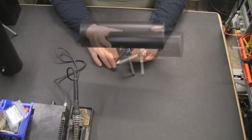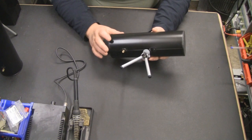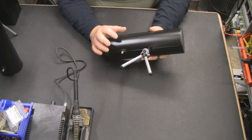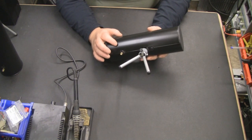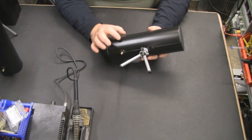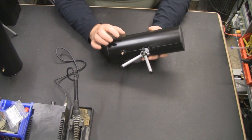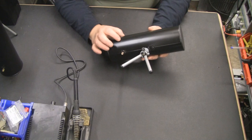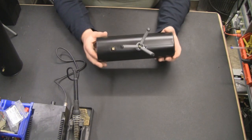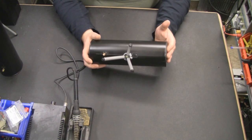Another revision is because now that I've got test equipment in the workshop, the wavelength for the cantenna I originally used was a little bit too long. So the driven element in this video is cut down to 31 millimeters, which works perfectly with the 90mm diameter of this cantenna.